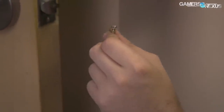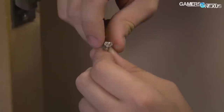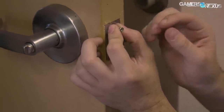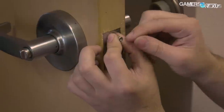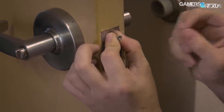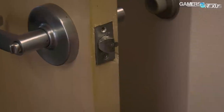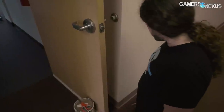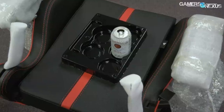And the problem is, if you drill through all the head, you kind of limit your options on removing it on extraction. So I ended up just cutting it short on those. I haven't used them before anyway. And I did the tap method, where you get a flat head and just lightly hammer it in and it turns. So that worked great. And we're good to go now. We can replace this handle, throw out those screws and never use them again.